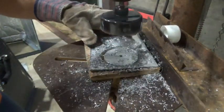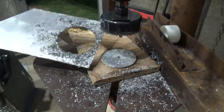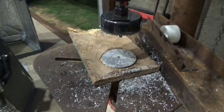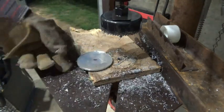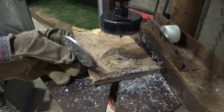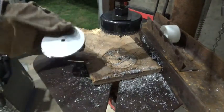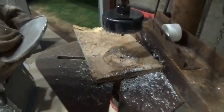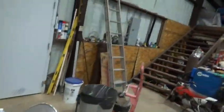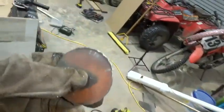I've cut a hole in my plate. Before you can use this piece you've got to really clean it up with acetone or the weld will not stick. Let me check and see if it's the right size for my prop, then I'll clean up the edge with the flapper wheel again so I have an idea how accurate it will be.